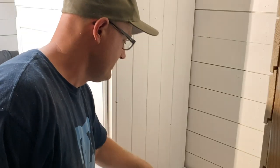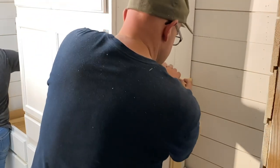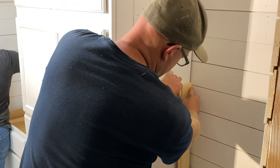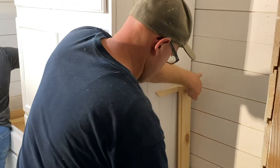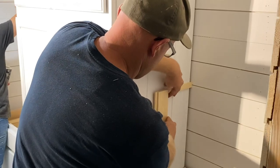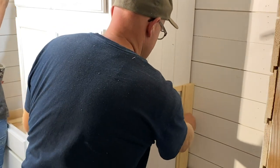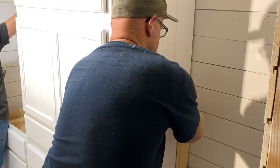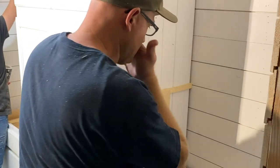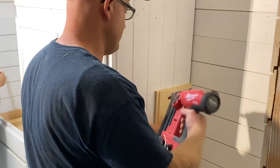On this side I got my story stick out. We're doing 18 inches to the top — that's flush right there. Make sure it's mostly level-ish. What story is your stick telling you? It's telling me 18 inches from the counter height. It'll actually be a little lower than that — won't be quite as high as the other side because we don't have the countertops on yet.